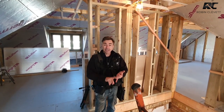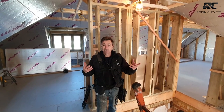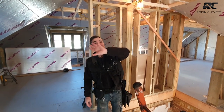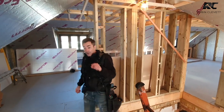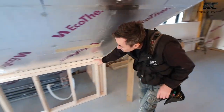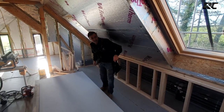You can build your walls before your plasterboard, but I like to have my plasterboard running through — it saves time and it's a better job. The plates for the walls hold everything together, and if you ever want to remove the walls or change things around, you've got your ceiling boards going all the way through. We'll do the ceiling boards across the top, then build the wall — it's really nice, saves a lot of time and it's a much nicer job.